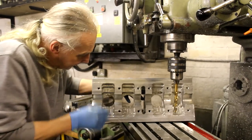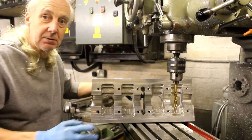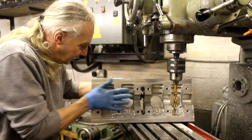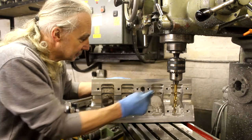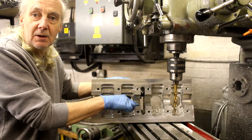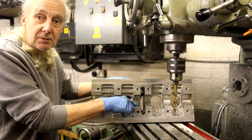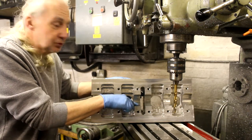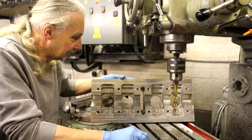I've just set all the dowels and threaded all the crankcase ones - there are a few studs. What I want to do is, when that lathe's moved, machine a mandrel up, clamp them in there, and then put another mandrel in the lathe and machine it to suit. But I thought you couldn't line bore it accurately all the way down with the equipment you had - you were looking to get somebody else to do it. You can do it, it's just having the right equipment. Finding someone to line bore it - there are people that can do it but you'd be talking a three or four hundred pound job.